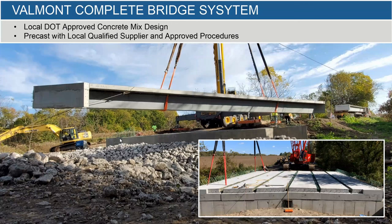If a precast deck is more attractive to your owner, you can choose to do a precast deck. Tubs typically support about seven feet of concrete, but we can get them as close as about five feet — pretty much next to each other. This is a good example of a precast deck used not only for the deck but also for a precast back wall. You can precast as little or as much as your owner would like. Instead of shipping the tubs to the replacement site, we would ship them to a local precaster who would do that work in their yard, and then the tubs would be shipped individually to the bridge replacement site. Then it's just a closure pour between panels to make that driving surface cohesive.